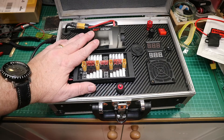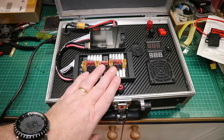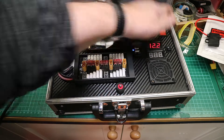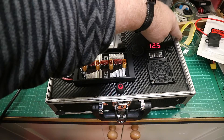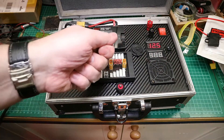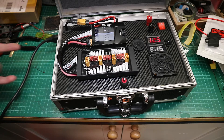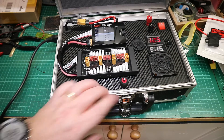So there it is - my portable charge station with the ISDT 150 watt charger and a balance board with 4 outlets on it, so I can put 4 batteries at a time. I've got the ability for 12 volts from there, and I've got my 5 volts - 1 amp and 2 amp USB for charging. It's a case of turning it on, and I've got the availability there and on the side there. If I've got any car accessories, I can plug in there. If I've got a charger that uses the old cigar plug, in there it goes. Everything's neat and tidy, packed away under the hood. There's a cooling fan there drawing air out, but air is entering here, so I've got fresh air going in and the warm air is being extracted.